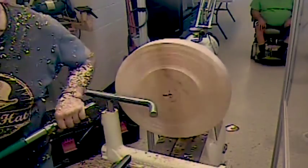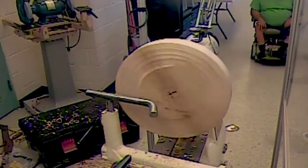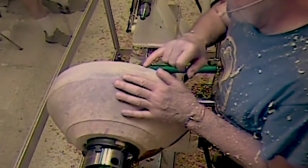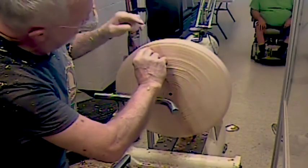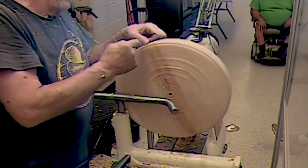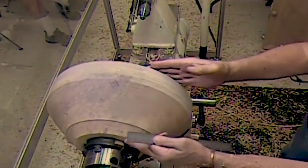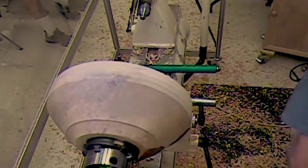And we have the benefit, too, if we're doing a range rider hat, that up-curving shape of the brim helps us get away from that pith check. It only goes about 5/16 deep this way. It's barely open. Goes 3/4 up this way. 5/8 worth of wood here to there. I can go up the 3/8 and still be happy and get good crown height.